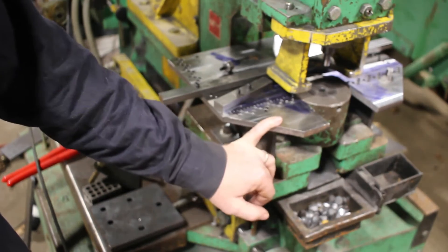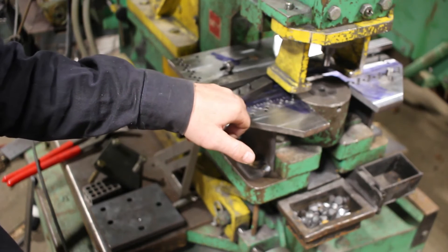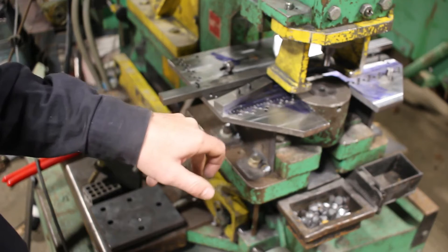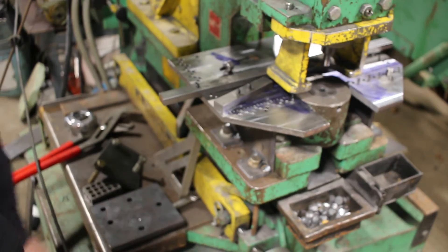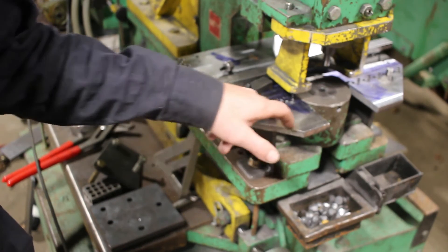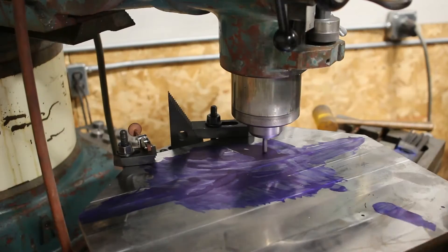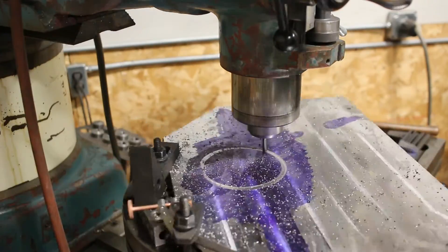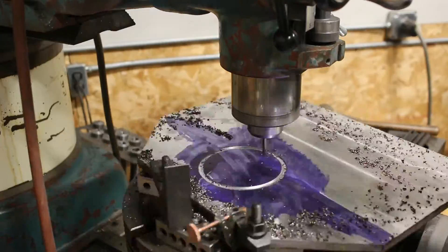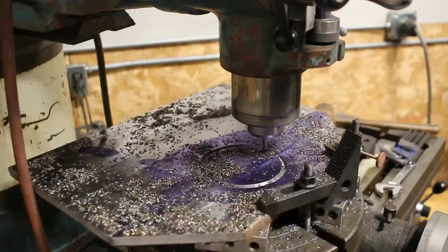If somebody's going to make one of these, CNC would definitely be the way to go. I used my digital readout to line up all these holes, and it worked really well as far as a manual machine goes. But doing that sort of hole pattern is just really slow compared to what a CNC could do — it could just zigzag along and get them all just right. Here's some footage of me actually making this and drilling the holes. I had it set up in the mill on my rotary table so I could cut the circle for the die holder to go through, and my setup wasn't the best but it was good enough.